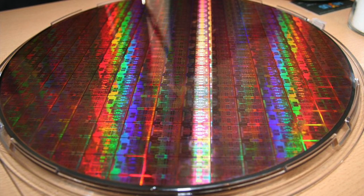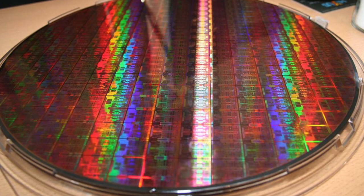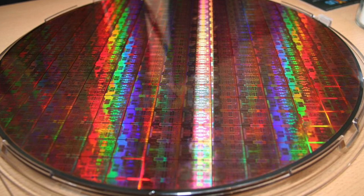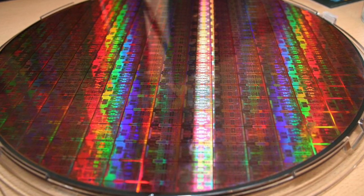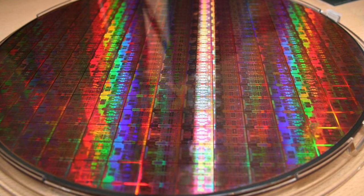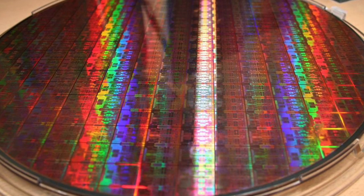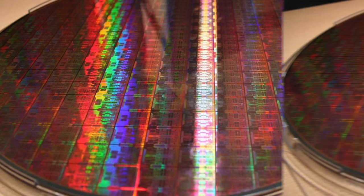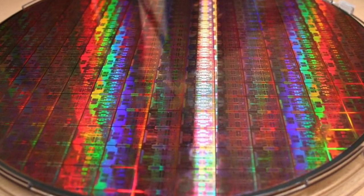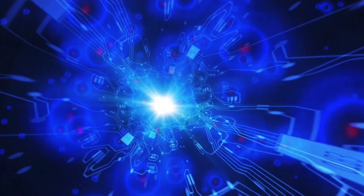After the silicon is purified, it's formed into what are called wafers, which resemble mirrors more than the cracker kind of wafer. That wafer is polished and a photosensitive chemical is applied, kind of like what's used in film. Then ultraviolet light is shone through a stencil shaped exactly like the transistor layout that engineers created for CPUs. Because wafers themselves are usually quite large, the process of shining through the stencil can be repeated many times, fitting hundreds of CPU dies into one single wafer.